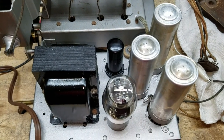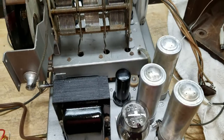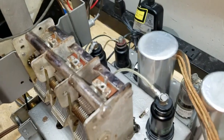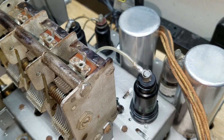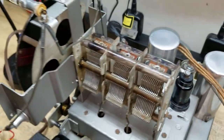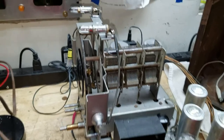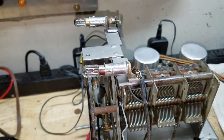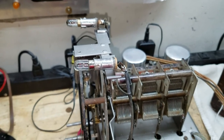He gave me some new ones with the radio, but he did not have a rectifier, so I got a nice 5Y3 that tests really strong. And he needed one more 6K7 than he had, and he needed a 6A8, and I had both of those, so you see those tubes are nice and new. This thing is pretty much ready to rock and roll. I suspect those lamps on the top will not work because I have not cleaned the paint off yet. I'm not sure where the dang things mount, so I don't want to clean the paint off till I know that.